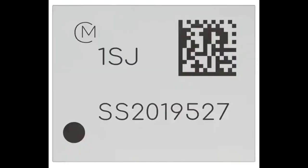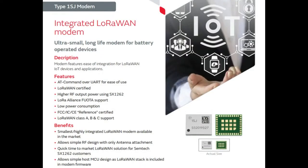This very tiny module has everything you need to make pretty advanced LoRaWAN-powered projects. It's the end node — not a router. But if you're making a product or project where you want to add long-range, multi-mile communications and you don't want to spend money on SIM cards, cellular, or NBIoT, and maybe you're outdoors so you don't want to use Wi-Fi, LoRaWAN is a really good option.